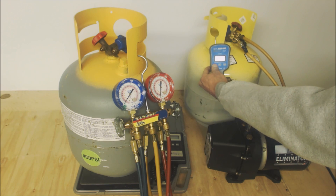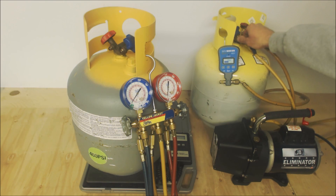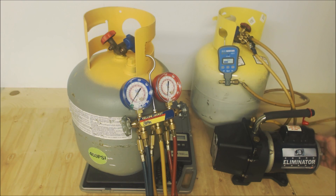We're going to go ahead and turn this on. What I like to do is leave at least one hose a little loose whenever I turn a vacuum pump on. The red cap is off — this is where the pump pushes out any water vapor or air that's pumping out of the system.